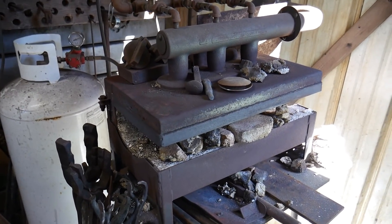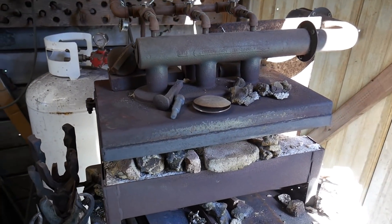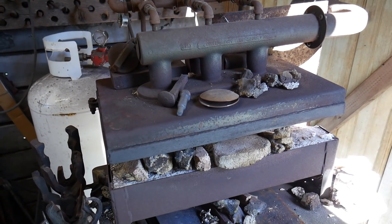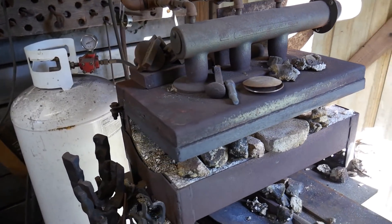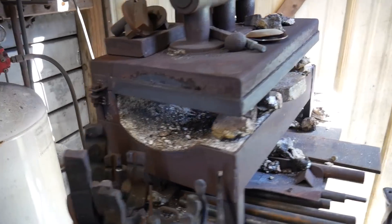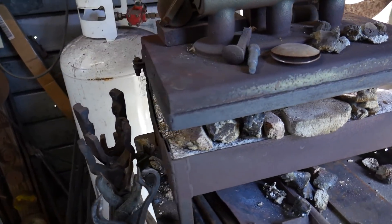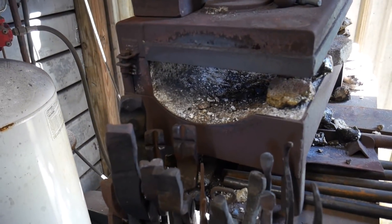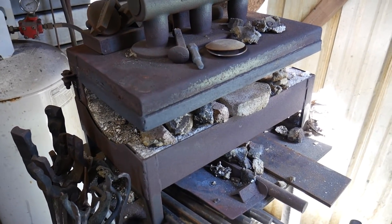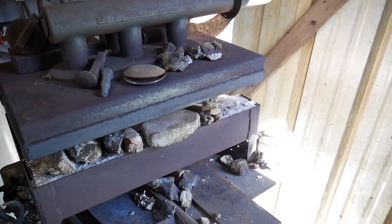When you're considering building or buying a gas forge, you want to buy with your maximum capacity in mind. That means: how big of a piece of material can you fit in here, and will that work for you? Also, does it work for things like scrolls? Are you working with mostly flat straight material, or something that's going to be bent up in crooked, different, weird ways as your main body of work? All that will go into your buying decision.